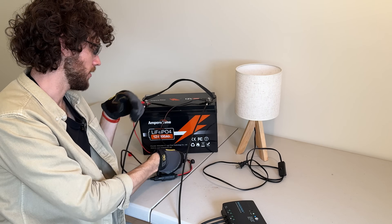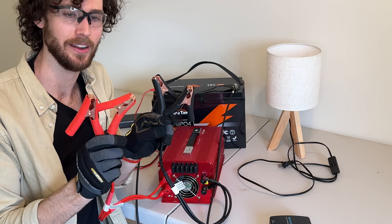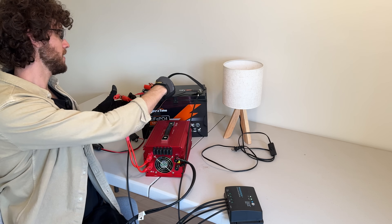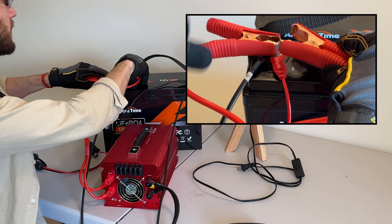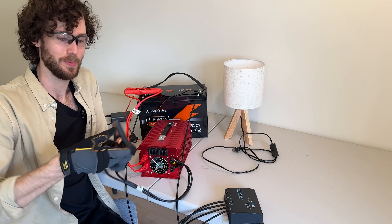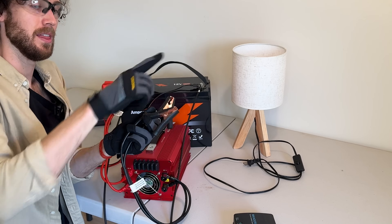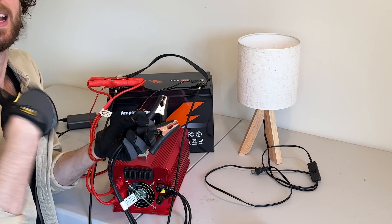If you did not connect your inverter in step one, then it's time to do it now. This is a 2000 watt inverter and it does not have ring connectors — it has alligator clips. So I just have to clip these to the correct battery terminal, obviously positive to positive and negative to negative. I'm going to start with the positive cables and clip them to the battery terminal. With this one I like to do one sideways like this, then grab the other one and peel back the plastic parts and clip the second one that way. Then I repeat the process for the black ones on the negative battery terminal. But warning — there's about to be a spark. This is a big inverter, so when I complete the connection by touching these alligator clips to the battery terminal there will be a spark. It always startles me a little, but fair warning. So I'm going to touch it to sort of get the spark out as we did before.